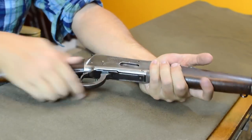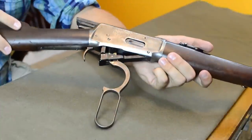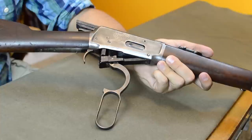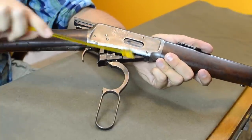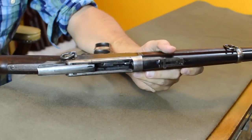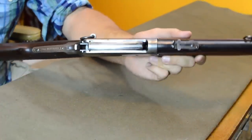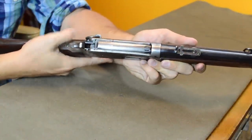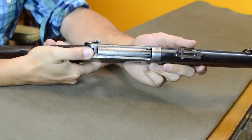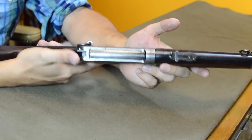So, mechanical differences, really. We've got one in the form of opening this lever arm and seeing, I'm sorry, try to keep in frame, that the receiver is dropping out the bottom. Man, whoops, dropped my thing. The receiver falls away in order to give us a longer stroke on that breech block, which means a longer cartridge overall. Additionally, if you're curious, that locking lug is now all the way at the rear, which we'll see more of in the animation, but this is a much stronger arrangement. Beautiful system, again, genius.